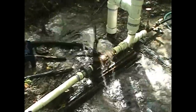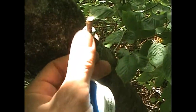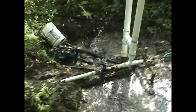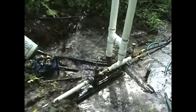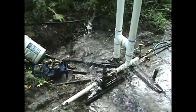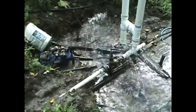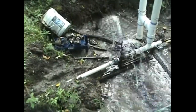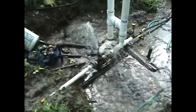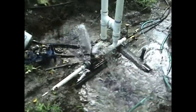What you're looking at right now is the valve with all of its weights off. I'll show you the weights quickly — all of those washers and the one rusty nut were on as weights, and that changes the cycle. This pump with all those weights on runs at about 54 cycles per minute; with all the weights off, it runs at about 63 cycles per minute. Higher cycles per minute means less chance for the water in the drive pipe to accelerate before it hits the valve stop, and consequently less energy conducted forward through the secondary check valve. So if your cycles per minute goes up, your volume delivery goes down; cycles per minute goes down, volume delivery goes up — as a general rule.